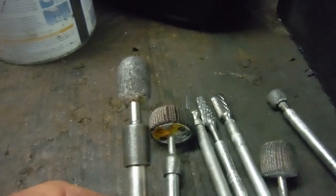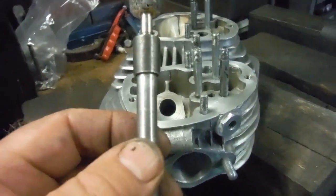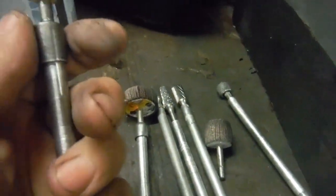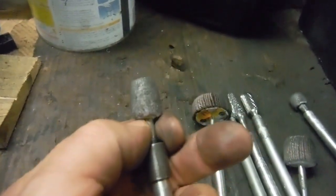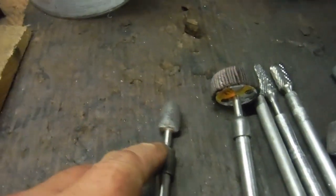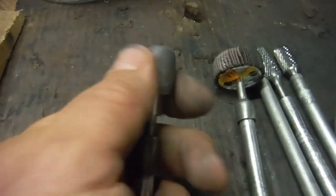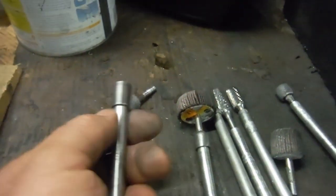This is something I've done to help get round that, and rather appropriately these are pieces of Royal Enfield bullet push rods. What I've got here is the stems of some of the flap wheels — I haven't done it with all of them but I've got a good few. I've cut a quarter BSF thread on them so that I can screw them into the threaded ends of the push rods, or what were the threaded ends of the push rods.